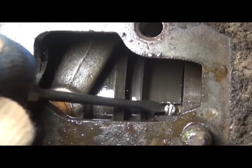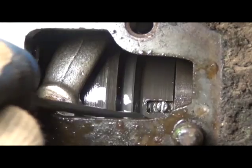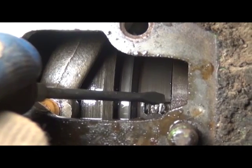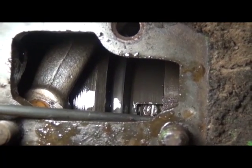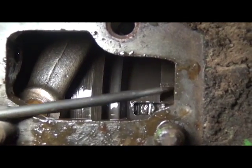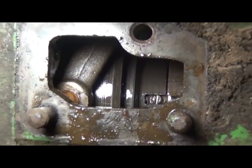Now we're going to disengage the clutch and engage the brake position, so like the little lock we talked about on the quadrant up top, and then push the indicator rod in. If everything's adjusted properly, we should see 2 lands and 2 grooves, which actually we lucked out and we do see that. If you don't see 2 lands and 2 grooves, then we'll go into the procedure for adjusting the clutch.